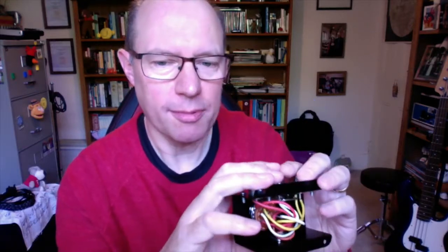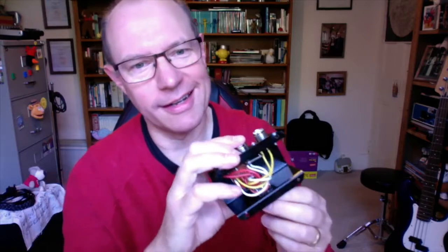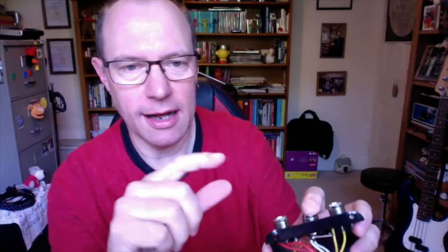I thought, well I could just buy another one like a lot of people say — just chuck it and buy another one. But there are some people on the net who have modified it, and those of you that know me will know I can hardly resist the temptation to build things and modify things. So that's what I'm going to attempt to do. I'm going to replace this connector with a proper solid SO239 with the four screw holes and fixed plate, and rip all that wiring out.